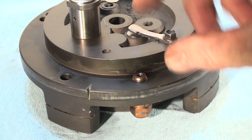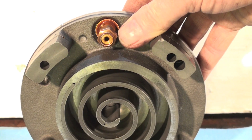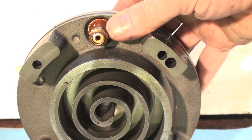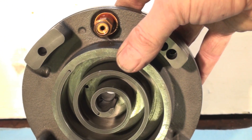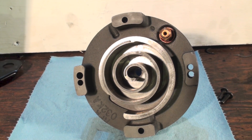We've got one more part, and you can see it goes from high side to low side, so it's a high pressure bleed-off. If the head pressure gets beyond a certain point, it bleeds back into the low side. At least I know what that one is.